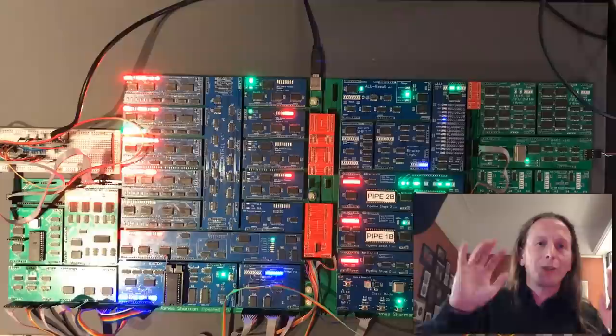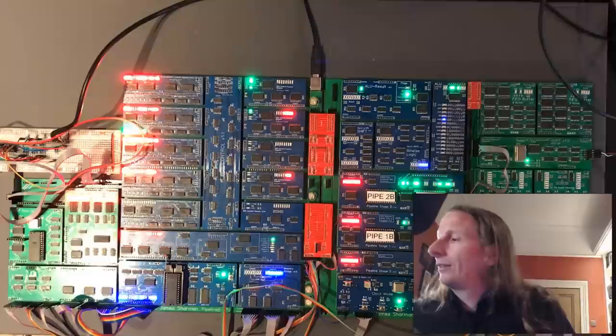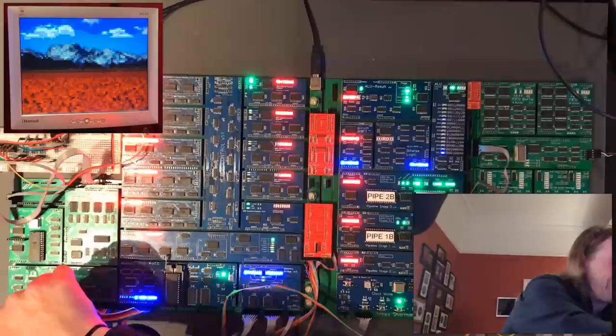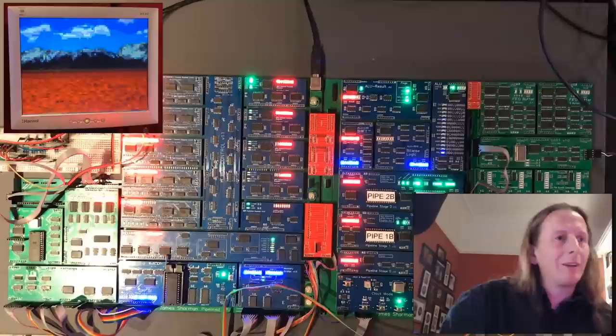Actually, no, stop the press. I came up with a really crazy idea. Check this out. I'm going to run one of my other demos without any code modification. Now we can see here the scroll registers completely messing up. But now what I'm going to do is invert the bus inputs on memdata. And you notice that starts to work,